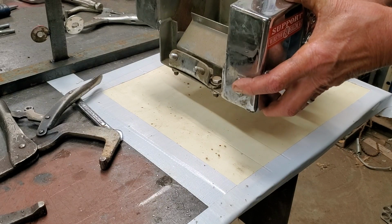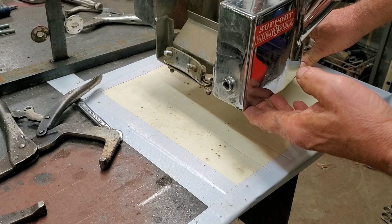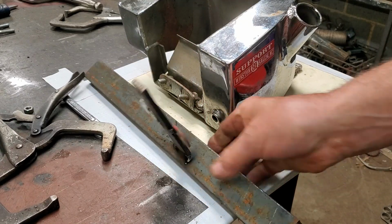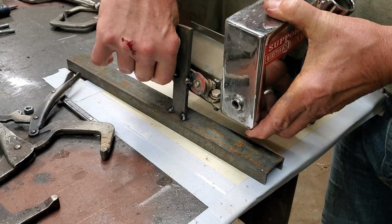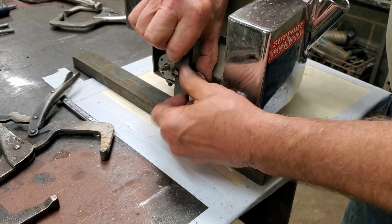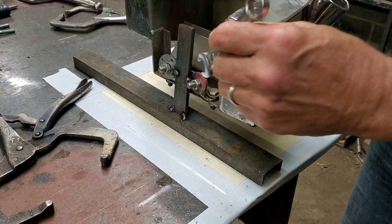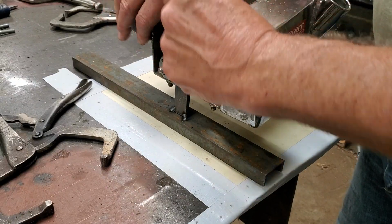Again, the problem was you need this tank to be up there so those tabs are flush on the table. When I build this, I don't want to build it with the tabs not in the proper place. So what I did earlier was I made this little jig to put these tank bolts in, just like that. And I'm going to tighten those up on here, and I'll show you what they do. They hold those two tabs in the front straight on the table. And when I clamp this, then I can mark it and remove the tank, leave this jig clamped to the table, and when I put it back, the tabs will line up.